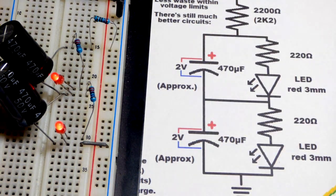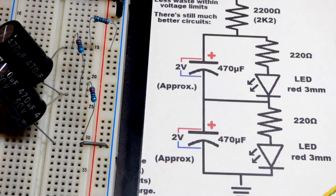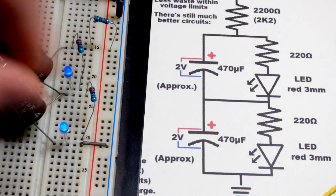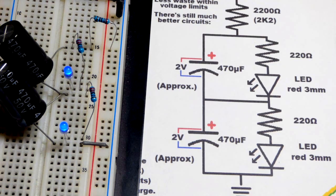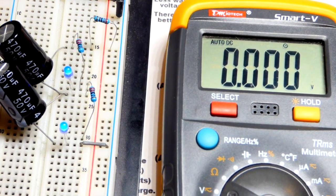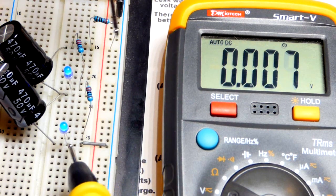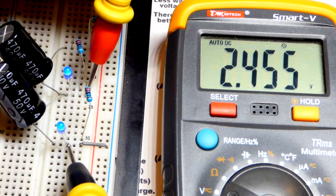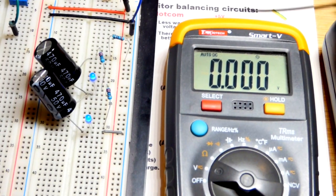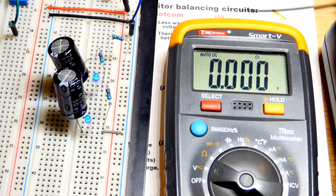Now we can make this a little better for splitting up the voltage. I'm going to yank the red LEDs and put in blue LEDs. That one lit up really quick and will go down over time. It's blocking more voltage, less current is flowing through it. Blue LEDs are just brighter to begin with and need less current to be bright, so they're still going to glow brightly and for longer. These block more voltage, and so now we get pretty much half of the power supply voltage. For this setup, this is working pretty well for charging them up. This video is mostly about getting them balanced and setting a voltage that they will charge to and hold.